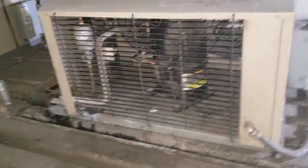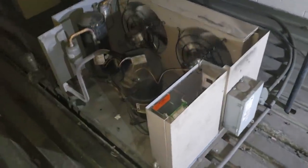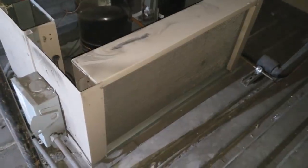Today we've got a walk-in freezer with a dirty condenser coil. This is pretty basic, but I always make these videos to help out the next guy. This is a micro-channel condenser, so you want to be careful about using chemicals. We're going to be using Viper aerosol cleaner today because it's micro-channel safe. My method: turn off power to the unit — I've already confirmed power is de-energized and the disconnect is working properly. We're going to wet down the condenser coil with water first to push out what we can.